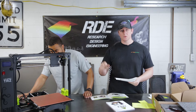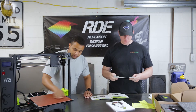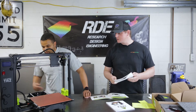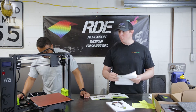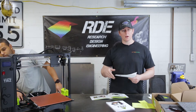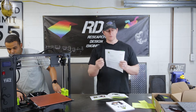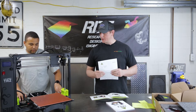Included was a list of all the tests and acceptance parameters for the 3D printer. They go through and check all the stepper motors, make sure everything is nice and square, and they also set your Z offset for you from the factory. This is also good because they keep a record of which machine it is, so if you ever had issues and sent it back, they'd know exactly what's been done to it. They also include a packing list that's been checked off by a human.